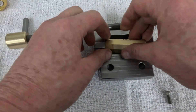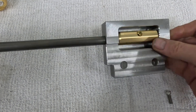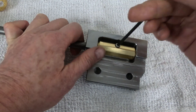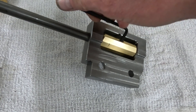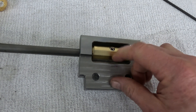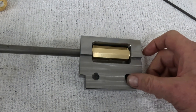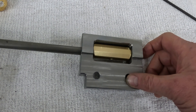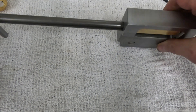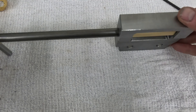Here's the cam — the screw is sub-flush everywhere so it can't score the cross slide. The head of the screw is the high point of the cam. When the lever is down and the cam is up, it'll sit like that on the machine and you actuate it like this. Let's get it on the lathe and see how it works.